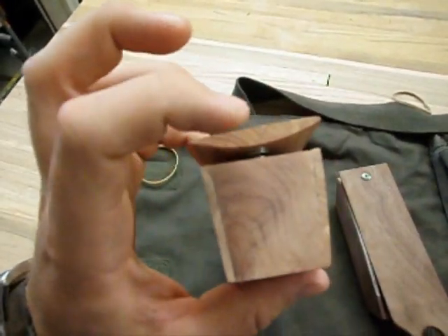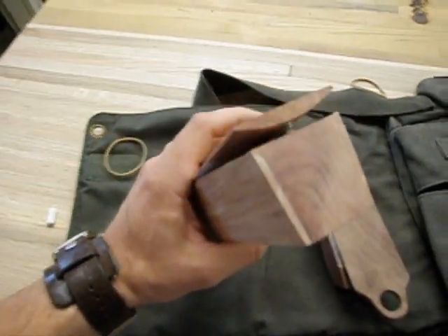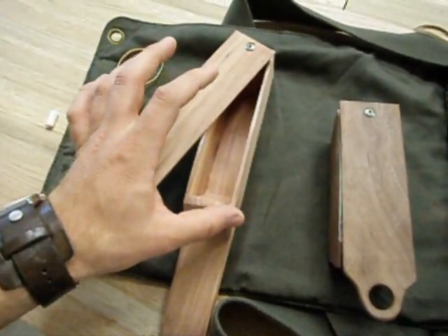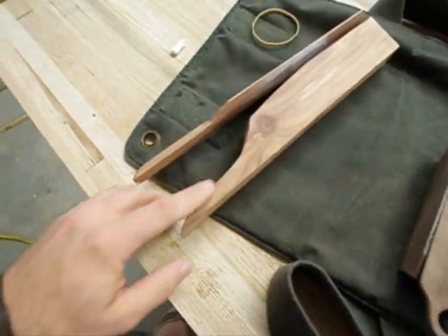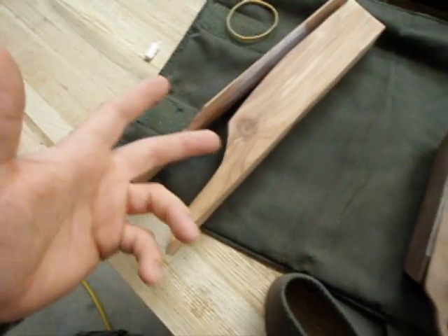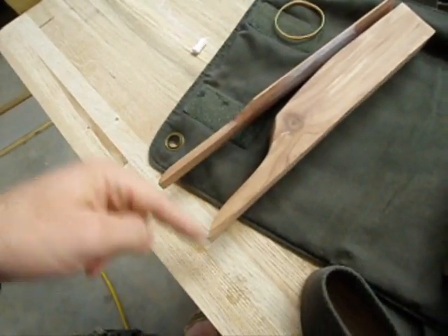The thickness of the top is a quarter inch. The thicker you go, the more arch you get that you have to sand into it - I think it gives it a better sound. The end of the box to this end is six and a half inches, so just figure for that. The handle - do whatever you want. I just grab different things around, like if I have an aerosol can and I want a round edge, I'll usually draw around that and then finish out my line.